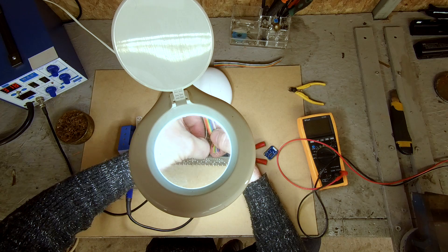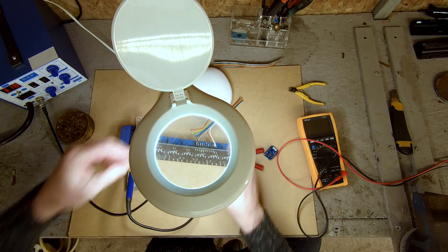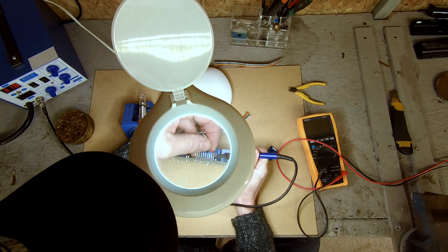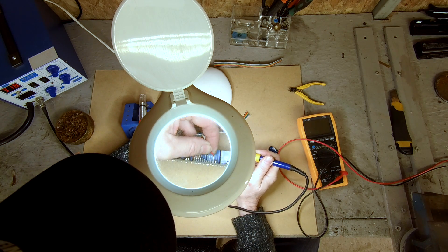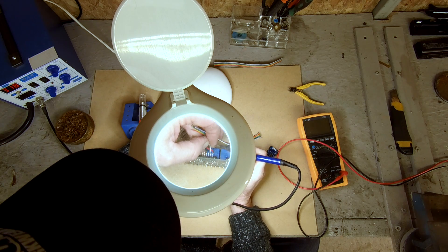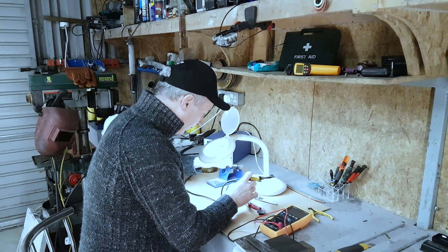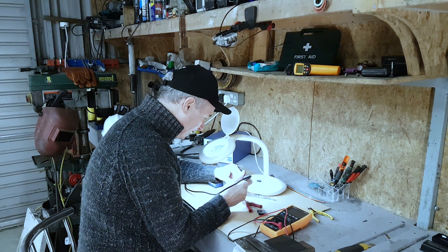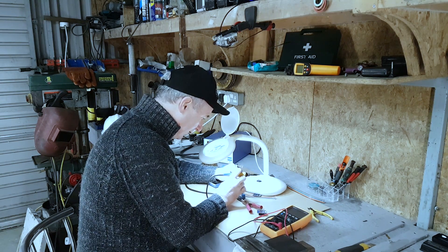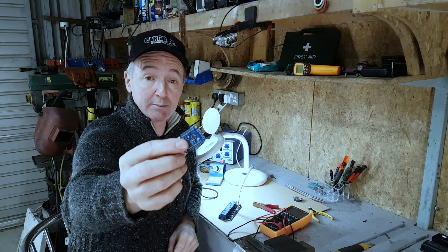Let's just move this around, give yourself a bit of room. Okay, so the white is going to be next. That red is kind of stretched over a bit — you definitely don't want any bridges between the joints. So now we're on to white. Okay, that's white on. I could really do with using this magnifier so I'm going to do that now. It's definitely easier with the connector — you just push it on and it's done — but for me I wanted it soldered. This is all low voltage side of things anyway. So blue is next.